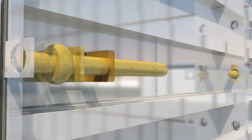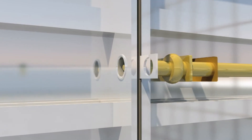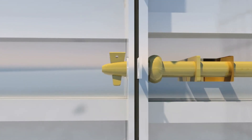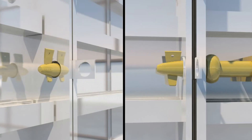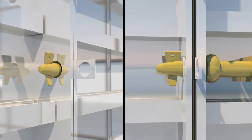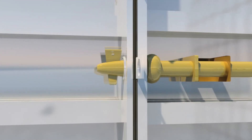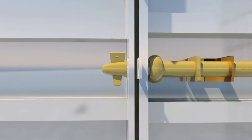As part of a continual process of upgrading product quality, MFS Faridabad has secured the holes of wall panels at wall tie locations with high-grade steel washers. This prevents holes from getting D-shaped due to concrete pressure, which may create offsets in the final finish. Additionally, pins are fixed at wall tie locations with a latch arrangement in the panel itself, ensuring better fixing of panels, minimizing the gap between two panels and wastage of pins.